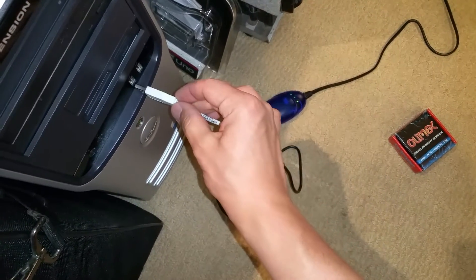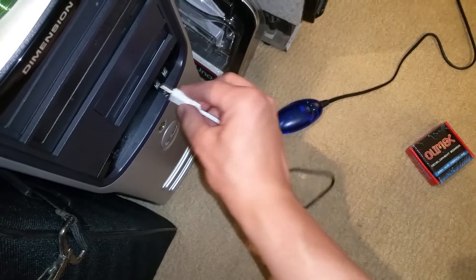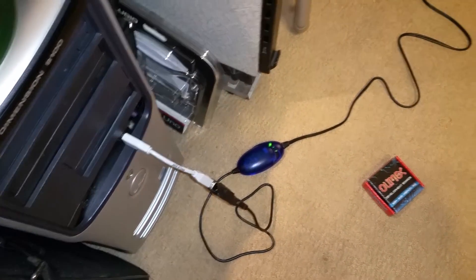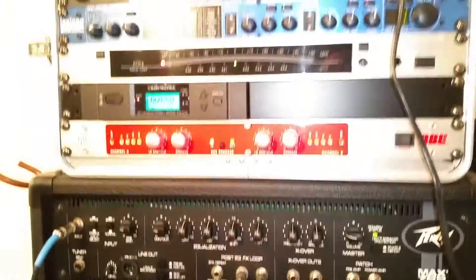But now I should be able to plug this in. And I don't hear a ground loop. That is the beauty of having a little $40 USB Isolator, because now there's no ground loop between the signal wires and the BNX3, which is going to the rest of my setup here.